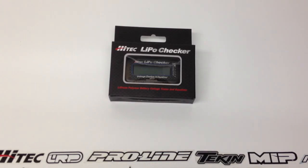This thing plugs straight into your balance adapter and tells you right away whether or not your battery is charged, how the cells look. The other cool feature is it actually balances your cells to the lowest voltage. So not only will it check the voltage and everything else, but also equalize things for you before you throw that battery back on your charger.